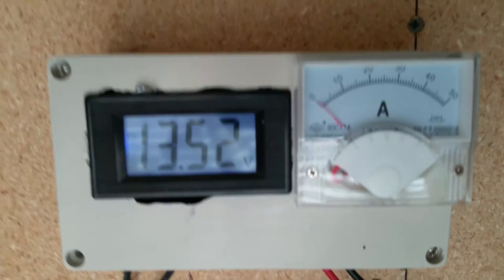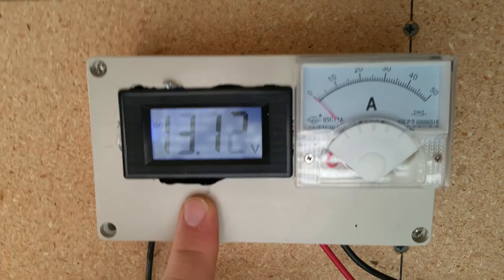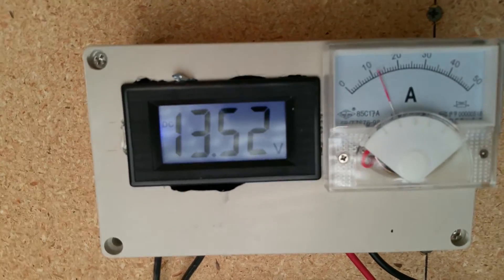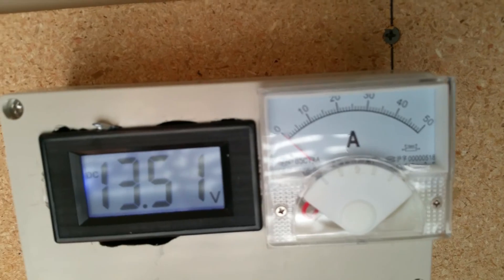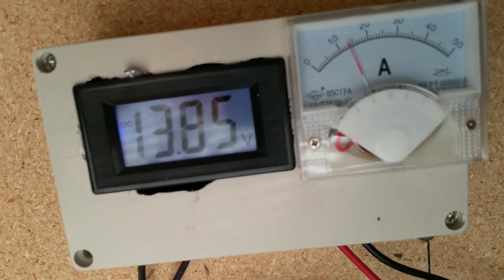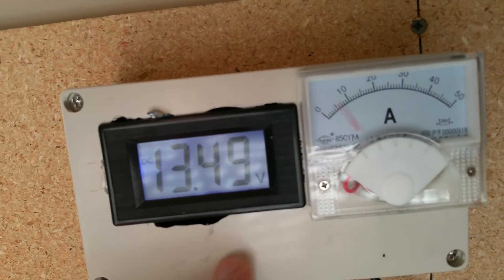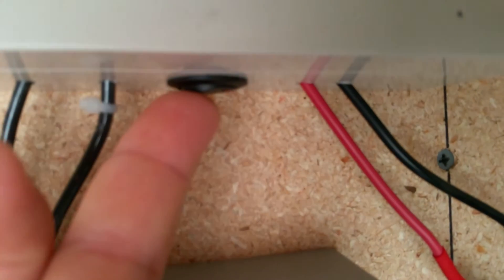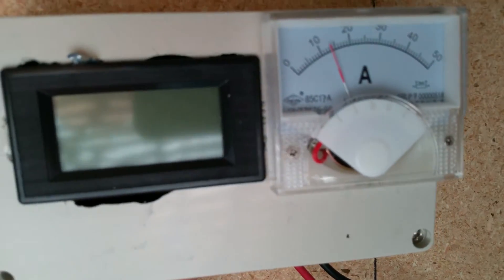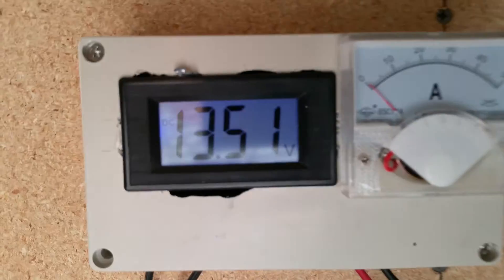Up here I've got this box — I need to fix it but I'm going to put some tape around it anyway. This is my voltmeter, just a standard blue light voltmeter that tells me the voltage of the battery bank. The charge controller is set to pull the charge away at approximately 14.2 volts and picks it back up at about 13.5 volts. I've also got a DC switch here that turns the voltmeter off at night so my wife doesn't have to see the big blue glow.